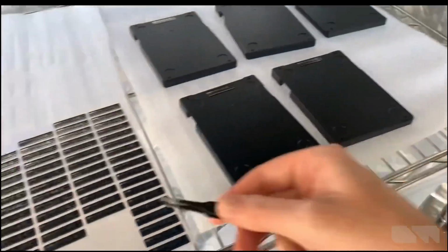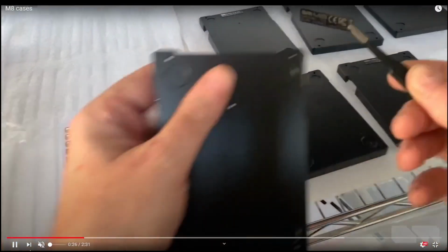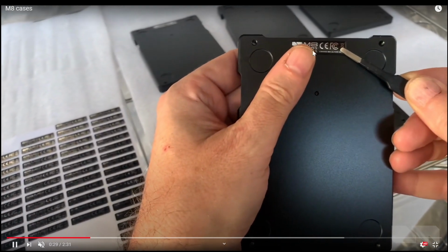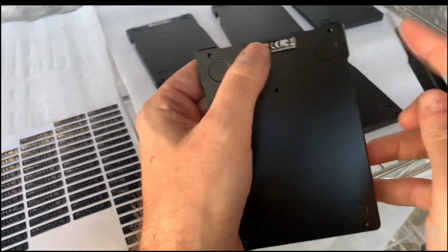So I'm doing everything myself, by the way. What I have to do when I get the circuit boards is put on all the keys, the keycaps, the screen, the battery, upload the software, test it, make sure all that works, screw the unit together, put the serial number stickers on there, put the 4 rubber feet on the bottom side, put it in the case, pack it, and ship it. But I'm manually placing the serial numbers because I have all that stuff right now.